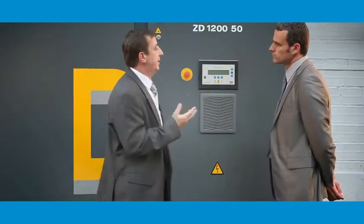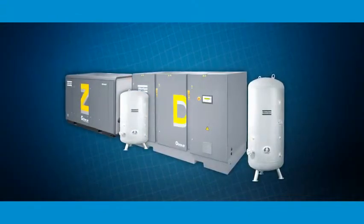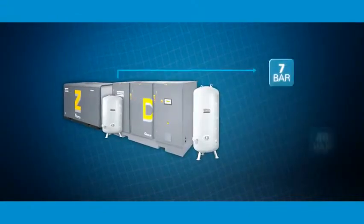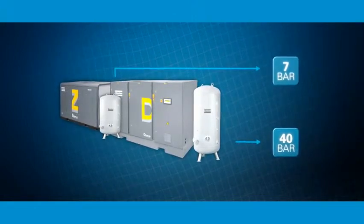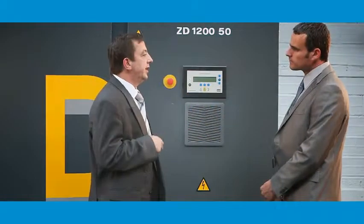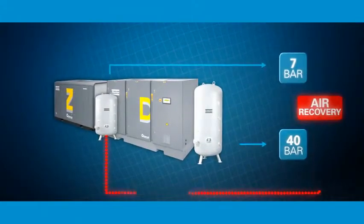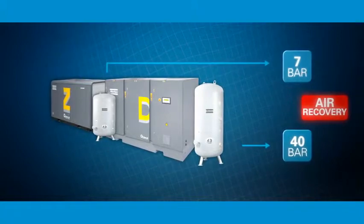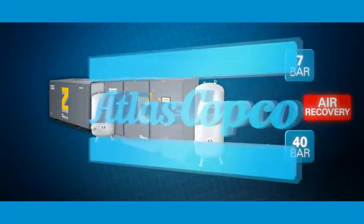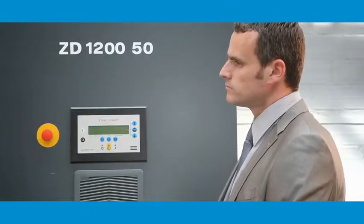First one, with a minimum of adaptation, you can manage your low pressure and high pressure networks separately. Just install a screw compressor with a bigger flow, and then you can supply your low pressure auxiliaries with no need for an additional compressor. Second example. If your blow molding machine is equipped with an air recovery system, you can re-inject the air back into the booster. That saves a lot of money. In that case, we always make a simulation of your savings.